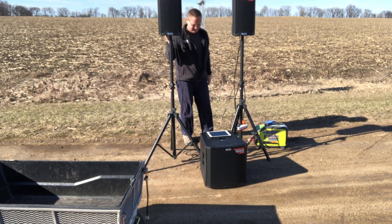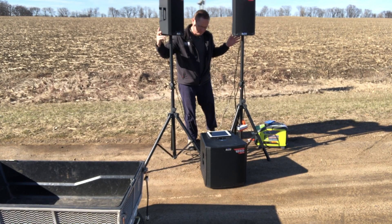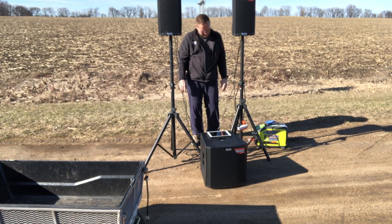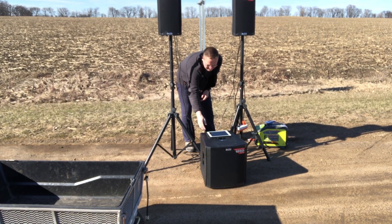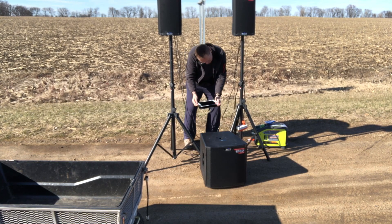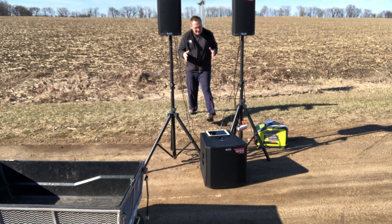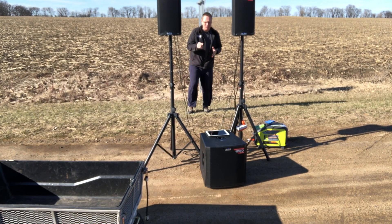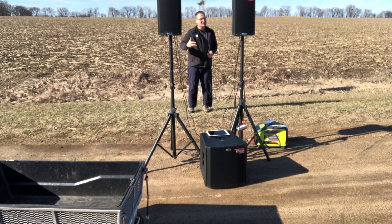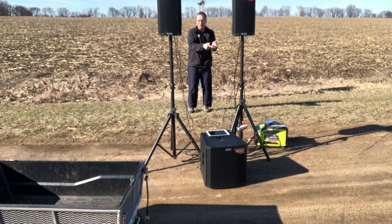Now we'll turn the other top on. We're at 66 to 70 watts of electricity being used. So we're at about 150 to 190 watts for the three speakers right now to achieve this volume, which is kind of loud on the other side — way louder than I need for a ceremony. The generator is just pulling along, probably in that 25% load range, which means that little propane tank is going to last about three hours at this volume.